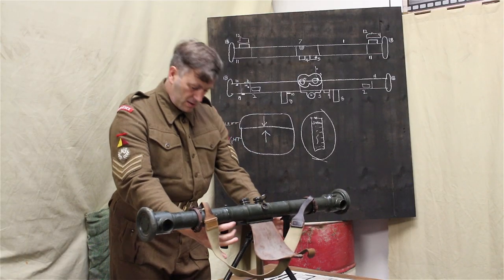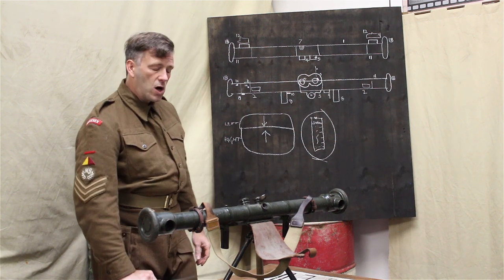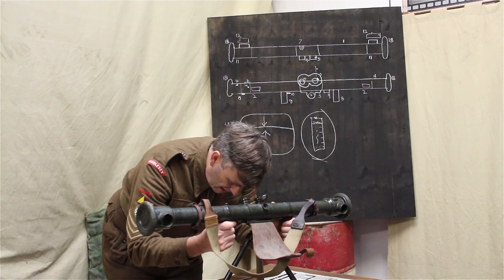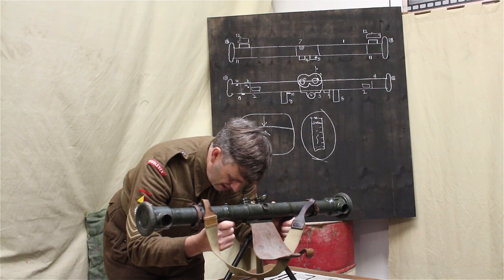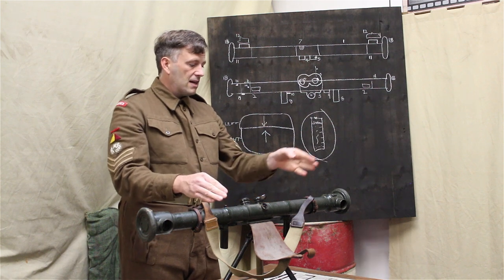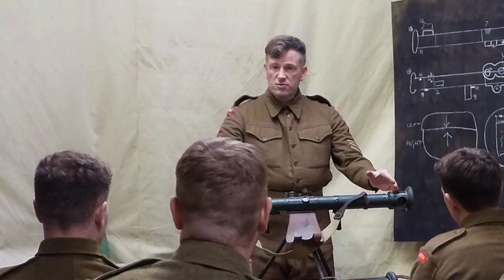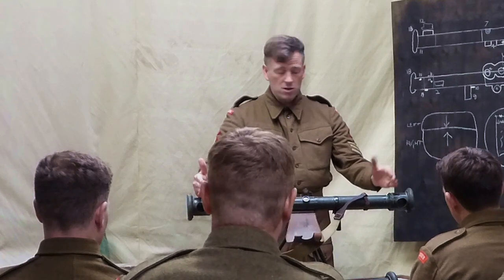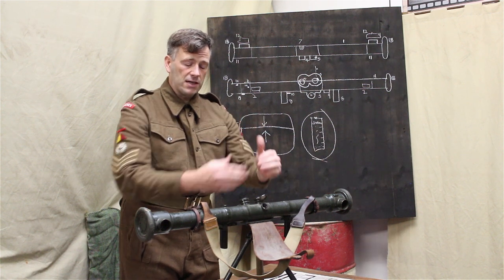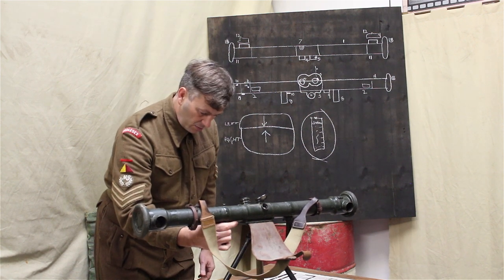And those handles are really important because the right handle here, just below it, marked up number 9 on the diagram, is the working head. The working head consists of a thumb piece there. Rotating it does actually move the range scale, and it is what is operating the left hand prism. So that's what then gets you the focus. It's worth remembering that the right hand prism doesn't move, that's in a fixed position. It's this left hand prism which you're adjusting with the working head, moving inside here so that you get the focus on the object that you're ranging against. The working head is what you'll be adjusting all the time while you're taking ranges against the object.